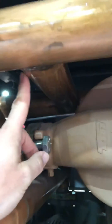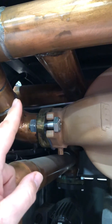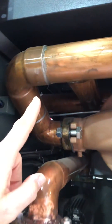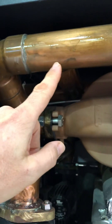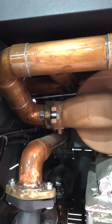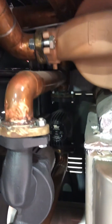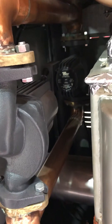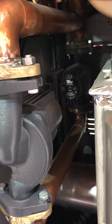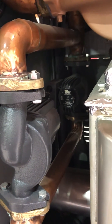To keep this simple — if you look up here there's a crossover bridge, and you can see that piping right there on the discharge. That allows it to short circuit and come back around to make sure we have flow through the main heat exchanger. The injector pumps are right here, so it's the equivalent of having almost like an H-bridge, or a second primary-secondary pumping system within the boiler.